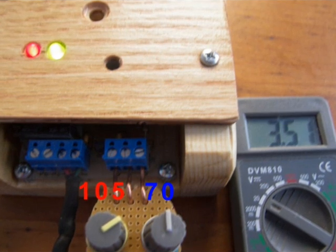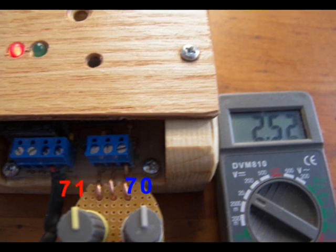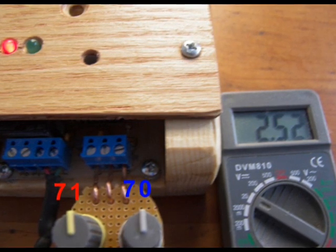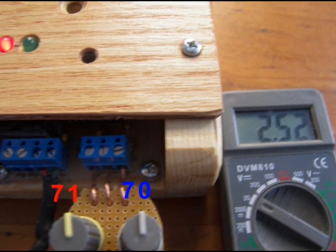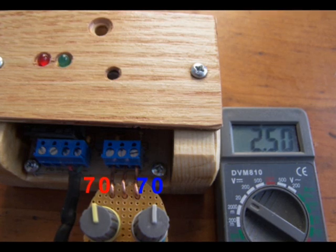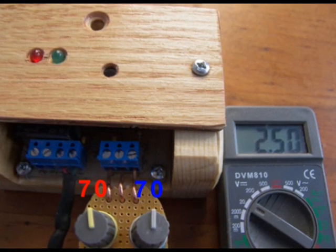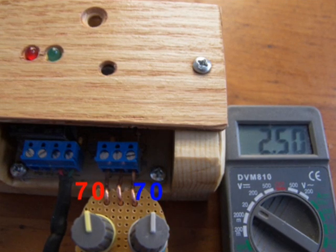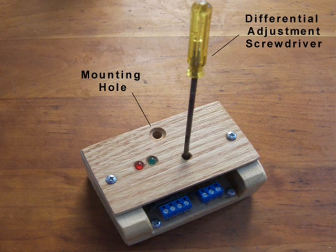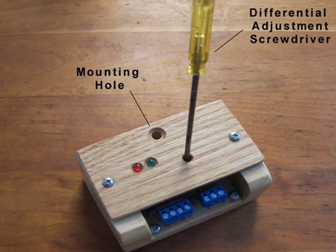What do you think would happen if we turned the collector temperature back down? When the collector temperature is turned down to 71 degrees Fahrenheit, the differential voltage drops to 2.52 volts, and the green differential LED is out. But notice the pump is still on. The latch circuit keeps the pump on until the collector temperature gets closer to the storage temperature. At a collector temperature of 70 degrees Fahrenheit, the pump finally turns off. This is a very low differential setting, and I do not recommend very low differential settings. Remember, the differential pot can be adjusted. A moderate counterclockwise adjustment maximizes heat gain, while a clockwise adjustment maximizes energy conservation. The best pot adjustment will normally be halfway between the Devil and the Deep Blue Sea.